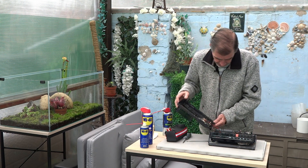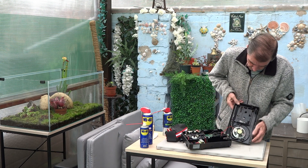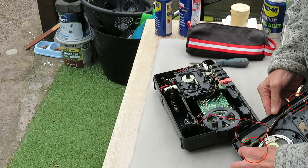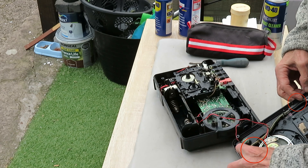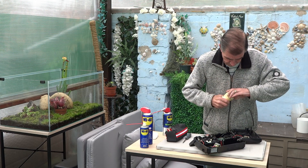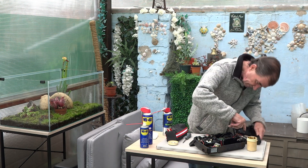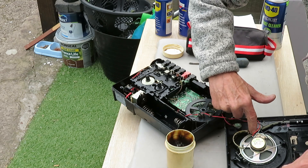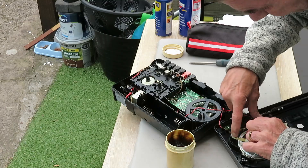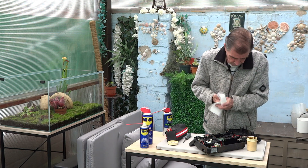I'm going to leave that as it is. This tape mechanism here is a little bit dodgy — it's a bit tight — and this just moves the indicator up and down the dial. What I'm going to do with that is use a little bit of LM grease. I'd normally use PTFE grease but I don't have any, so just a little bit of LM grease to grease the mechanism. I could take the tape out but that's going to be a nuisance, so I'll lift it out, smear a bit of grease on there — it won't really matter once it goes back together. Just wipe that off my finger.